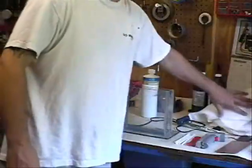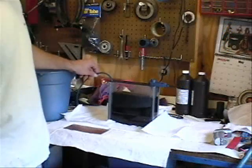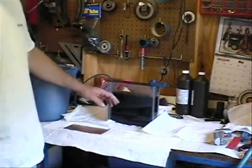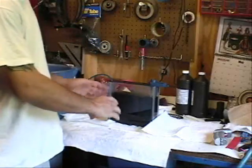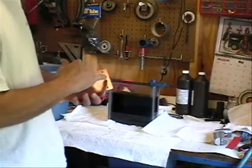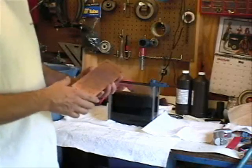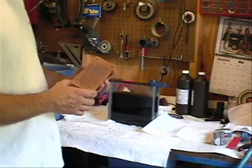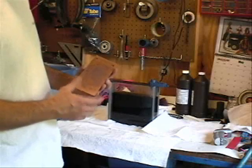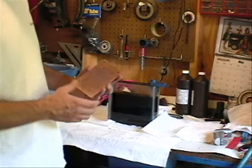And a mess of paper towels — it's going to get messy sometimes. And of course the boards you're going to etch. We've got it set up. I have the air pump hooked up and filled up with ferric chloride, and the heater is in. When you want to etch your board, you need to drill some holes to suspend it with. I use 1/16-inch holes and put them in inconspicuous spots. This one has a large border, so I just put them around the edge. If you don't have a border, you can put them in spots like underneath RJ45 jacks — that's a good spot.